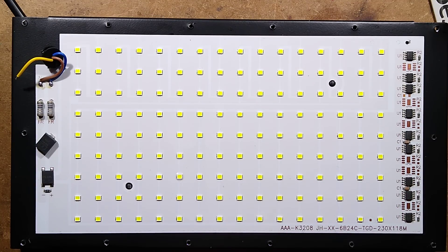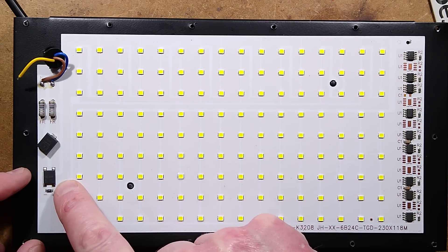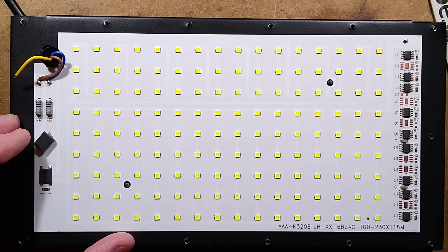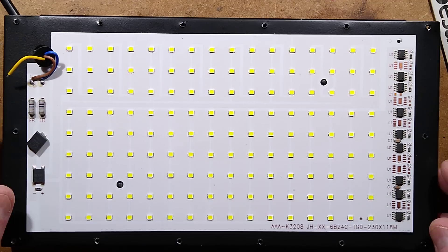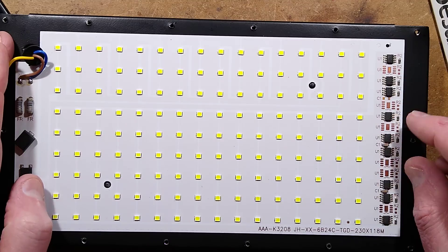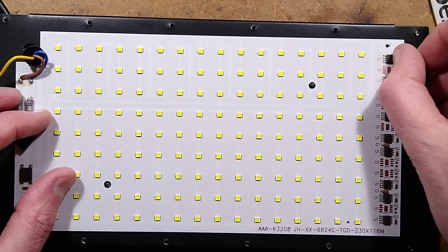The driver circuitry has two fusible resistors, a metal oxide varistor across that, a bridge rectifier, and a slight load resistor. One connection goes to one end, snakes through all the LEDs to the other end, and the other connection goes to the other end. Then we've got nine linear current regulators with a couple of capacitors across. There are positions for fifteen linear regulators total. These are the bits that were throttling the current, because as they heat up they have built-in thermal sensing — they're all in parallel and as they heat up, they start regulating the current back. You could cut the power of the panel down by adding an external capacitor in series, or just remove some of these resistors. They're all 6.8 ohm — just setting a current — and since they're current regulators you can put a whole load of them in parallel.